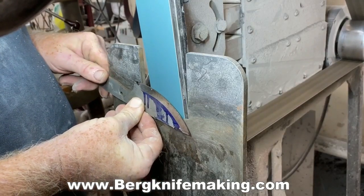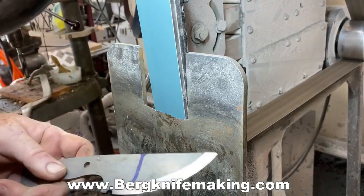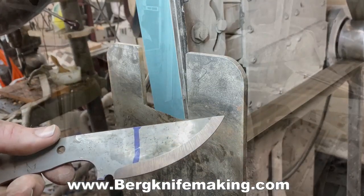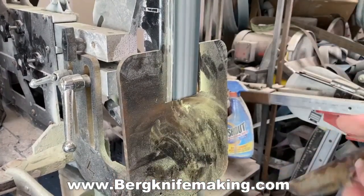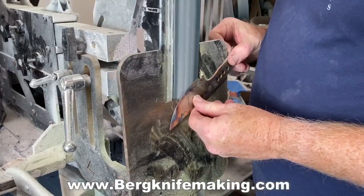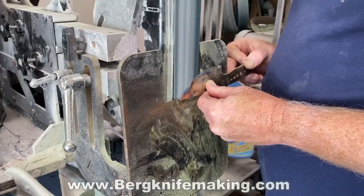The railroad tracks give you a visual reference so that while you're grinding, you can grind evenly to those lines. A nice bevel is really at the heart of most knife-making projects. I didn't show the heat treating process, but AEBL is heat treated in an oven at 1960 degrees for 15 minutes. It was plate quenched and then went into dry ice for a sub-zero quench. After that, it went into an oven at 395 degrees for two cycles of two hours, letting it cool completely in between without opening the door, for tempering.